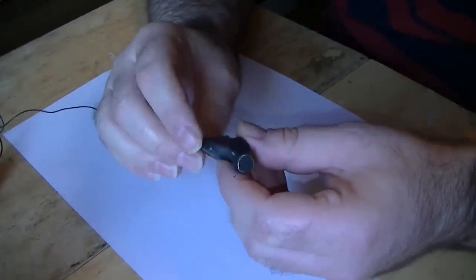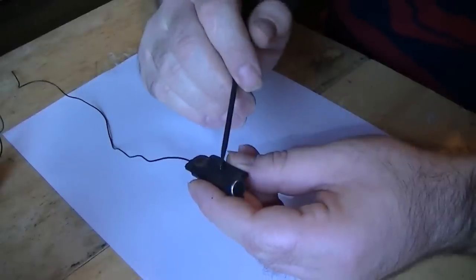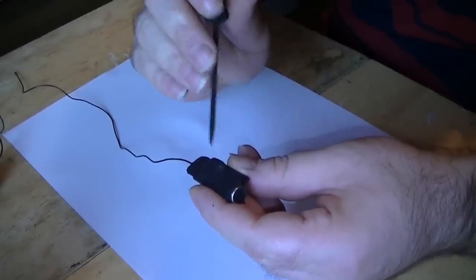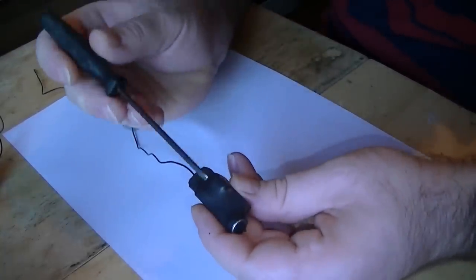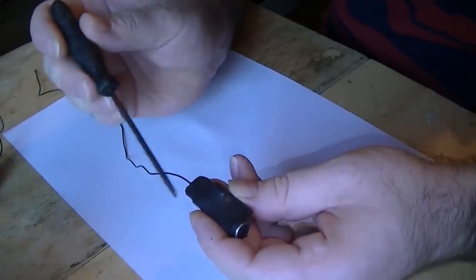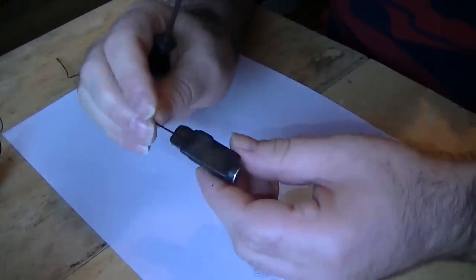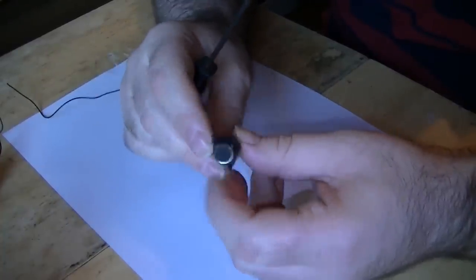Now like I said, this is a phase locked loop. The IC in this is a MAX1472, designed as an ASK transmitter, the modulation basically for transmitting data. But it's got a reference crystal here, and what we can do is manipulate that with a varicap diode. So that way we can achieve our narrowband modulation. So they're a cracking transmitter, I must say.